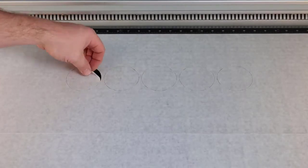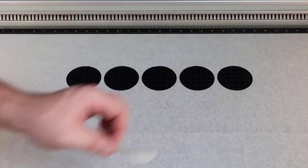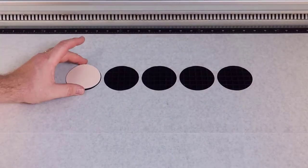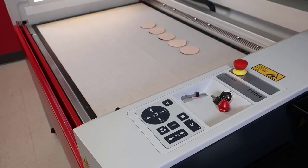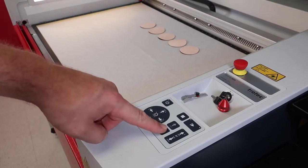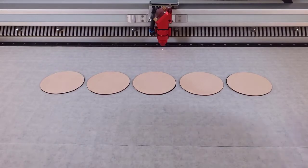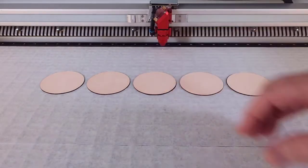Remove the tape to expose the openings. Place the leather or any similar thin flexible material into each opening. When the exhaust is turned on, the pre-cut openings will produce a vacuum pulling the parts to the table. Adjust the parts so that they are positioned correctly over each of these openings.